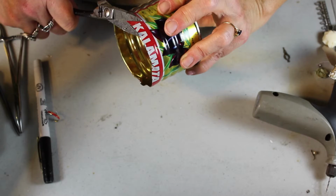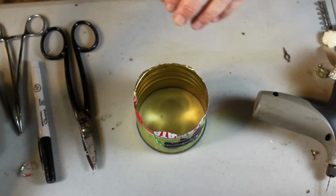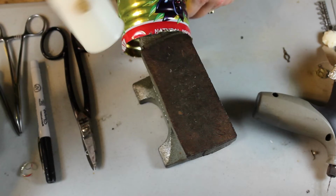Be very, very careful. These are extremely sharp. So you're going to hammer this with a steel bench block and either a plastic head mallet or a rawhide mallet. And because it's circular, you want to use some kind of an anvil so that you can place this right here. I'm not going to hammer the whole thing because it's going to be shaking the camera. But basically you go around,